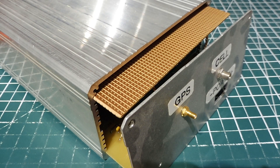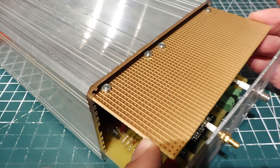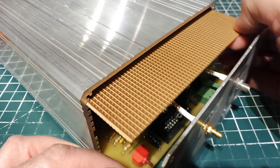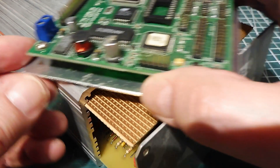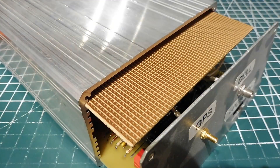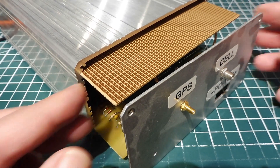For enclosures, you can get all kinds of aluminum extruded enclosures in different sizes, and you can cut your Vero board so it fits into the slots of the extruded aluminum box. If you have a board that doesn't fit into a slot, you can mount it on a piece of aluminum where the width matches the extruded aluminum box and then just slide that in. Those are a couple of ways to use enclosures with the Vero board.